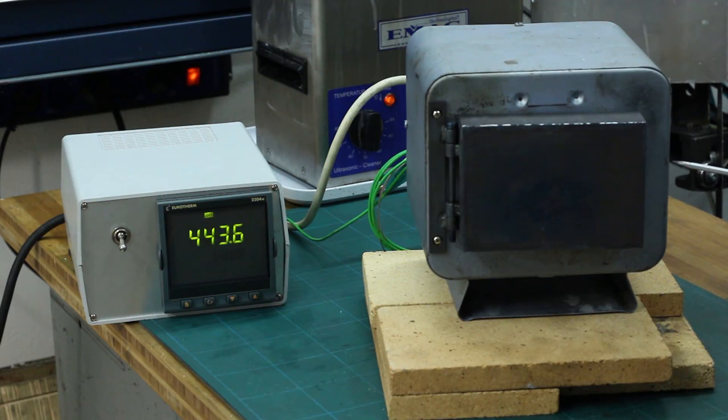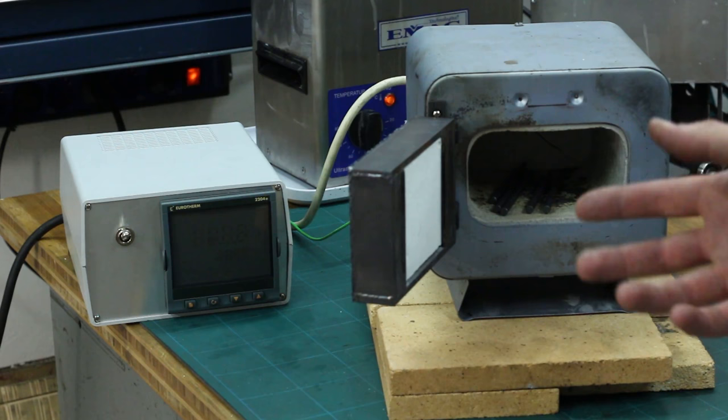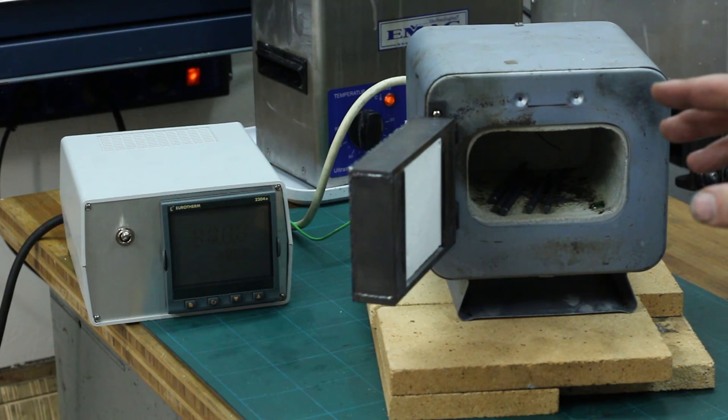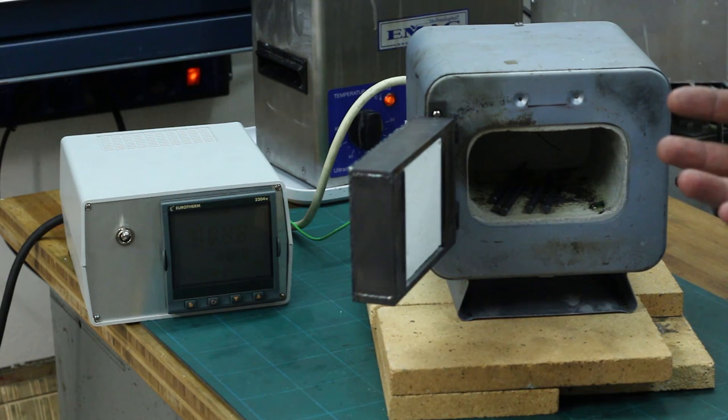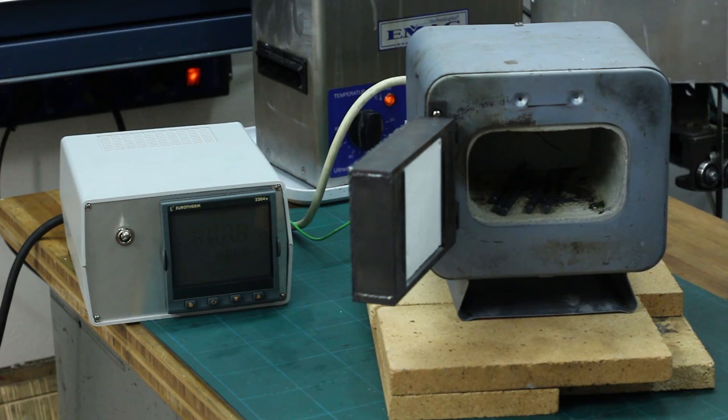Okay, I just reached 450 degrees, and now I'm opening the door. Of course, shutting off the oven, and I will let the parts cool down on air so they have the right amount of hardness. I checked the material data sheet for the drill rod, and for 50 Rockwell C, you should temper them at roughly 450 degrees C, and then let them cool down on air, and that's what I'm doing right now. Opening the door of the oven and just let it air cool, as they mention in the data sheet. And that should give us nice 45 to 50 Rockwell C.